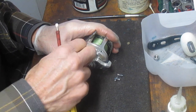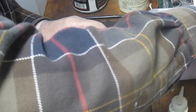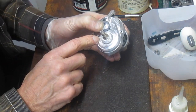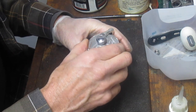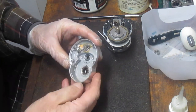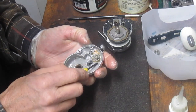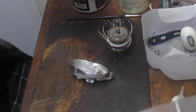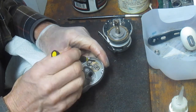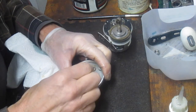The cap is coming off already. All four side plate screws are the same size, so they can go into my parts tray. I like the parts tray because it keeps all pieces and parts in one central place for reinstallation. Just hold on and gently lift off the top — it'll give you access to the gearing. On the back end of this we want to make sure everything is clean. This one's pretty clean; there's a little bit of dried grease up top, so now's the time to do housekeeping. I'll use that small screwdriver and then a cotton swab to clean up the rest of that dried grease.